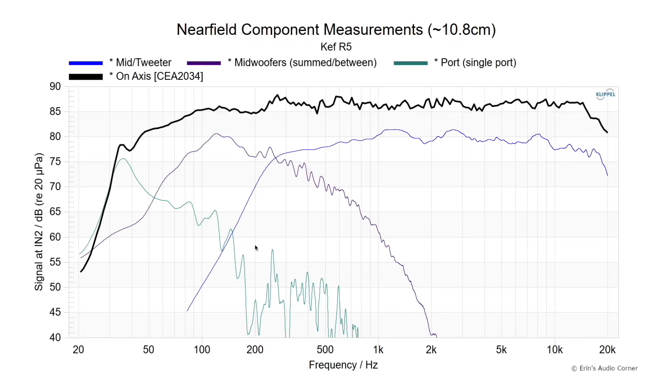Here are the near-field response measurements of each component. The black is the anechoic on-axis far-field response. The blue is the mid-tweeter. The purple are the mid-woofers, with the mic placed in between to show the crossover region. On the low end you have the port — I measured just the single port. I think this tells the story I needed to know about what was going on with that dip — sure enough, it is the port doing that. The other port may actually be causing the bump, but I mainly wanted to sanity-check this. I also took it outdoors and measured it in a ground plane method and got the same on-axis result, at least up into the high frequency where ground plane isn't very useful.